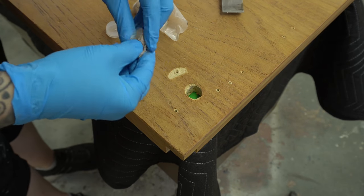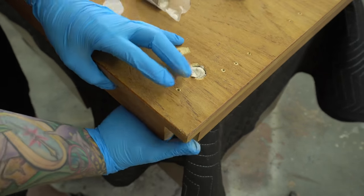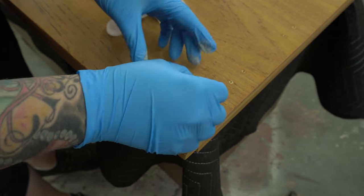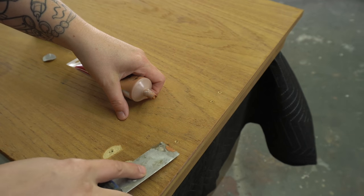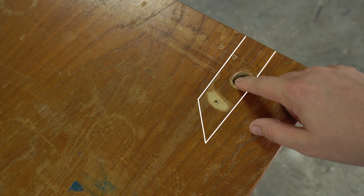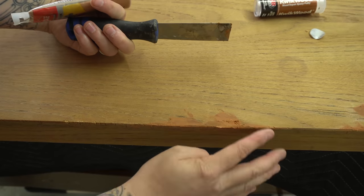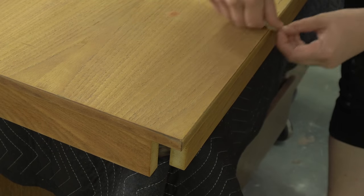This is how I chose to fill the big hole, but if I had this desk today I would do it differently. What I did was use some Quick Wood — a hard-drying wood epoxy — to fill the gap, and then teak wood filler to fill the rest of the holes as well as the top of the big hole once it had dried. Were I doing this piece again, I still would have used the epoxy inside the hole, but I would have replaced the surface area with new teak veneer, cut more on a diagonal — that would have been a much smoother and less noticeable patch job. I didn't have teak veneer on hand, which is why I did it this way.